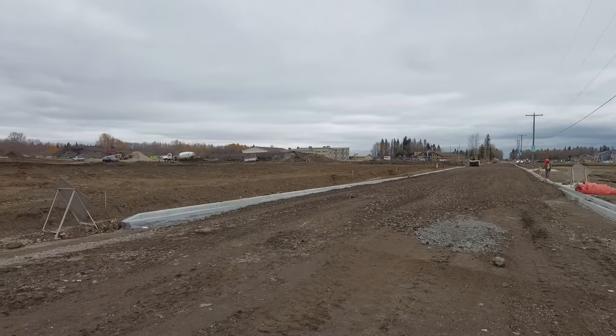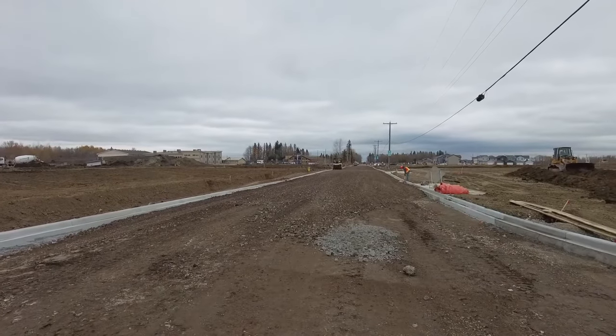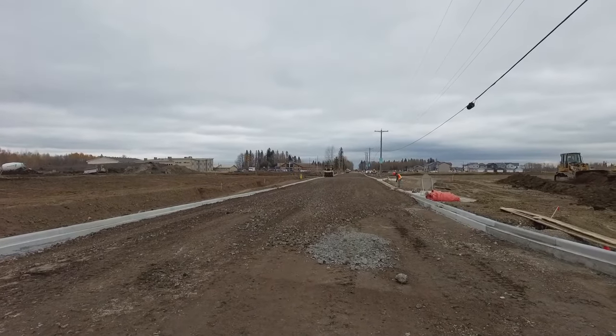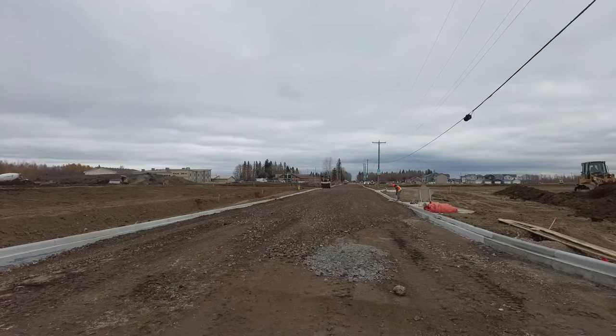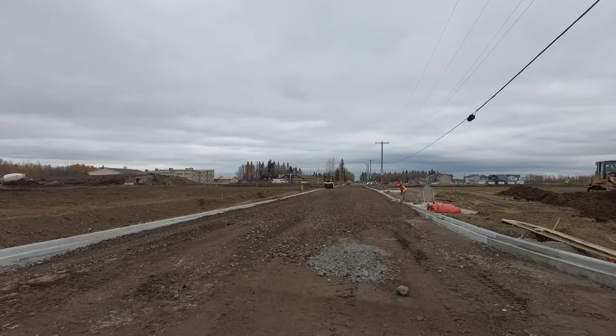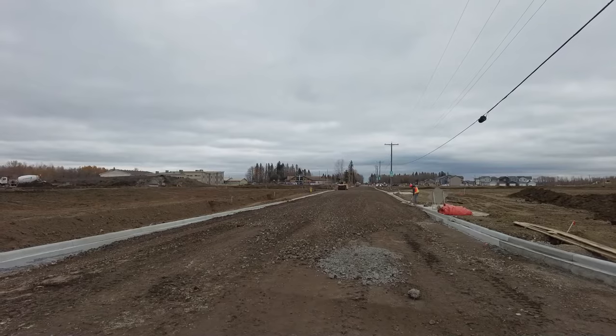Street building requires that the grader blade actually touch the concrete structures. In this video I am going to show you some mistakes that I've made over the years so that maybe you can avoid making the same mistakes yourself. Here we are placing some 63 mil — a very popular reclaimed material. There are three significant high points on this arterial road, and both sides are straight face curb. We're looking for about 100 mils of asphalt going on here.